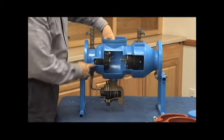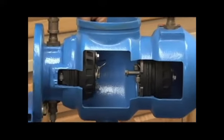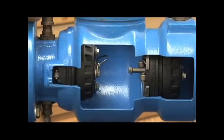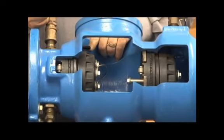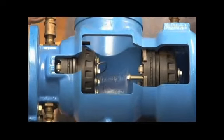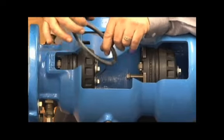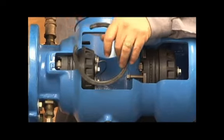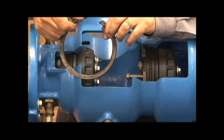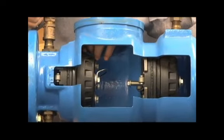The checks are held in by a clip, and you can see here this moving piece right there as I kind of wiggle it. What you're going to be looking at, I'll tip it back, is this right here. So you're going to see two little knobs on the end of your clip. In other words, looking inside that, what I'm looking at are these two pieces right here, allowing me to grip those two clips, squeeze them, and pull it out to let the check assembly. In other words, that's what's holding that check in the body. So I'm going to go ahead and squeeze it.